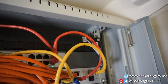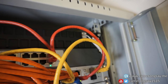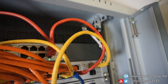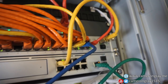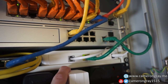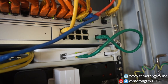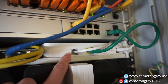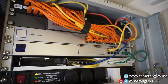You'll see the DSL port up there. That's working absolutely fine. And because I know people will comment, and this will be a good sign to see people who have watched the video before commenting and the people who have just commented without actually watching the video: yes, I will probably replace this at some point with a twisted pair Cat5 type RJ11 cable. This is just a cheap one it comes with, just a flat cable. And to be honest, I've never had a problem with them. They've always generally worked fine, it's a very short length. But anytime I show one in a video, people inevitably complain in the comments that it's not twisted pair. So I'll probably end up getting a twisted pair version of this in the future, but I've just not done it yet. But yeah, that's all installed there.